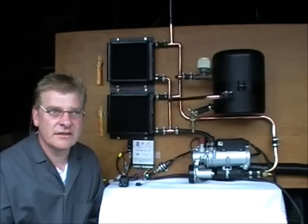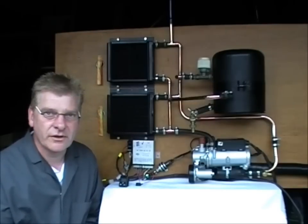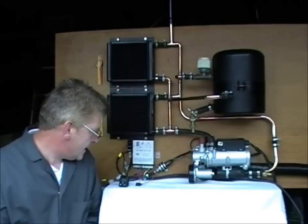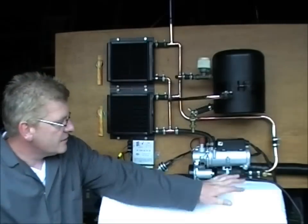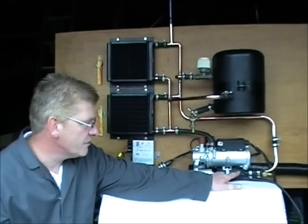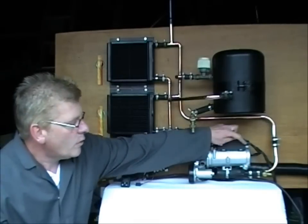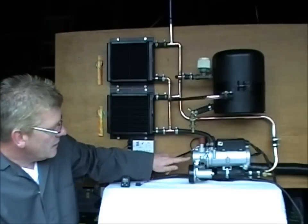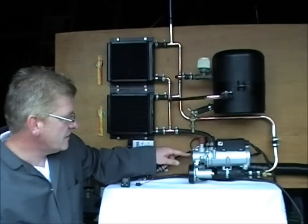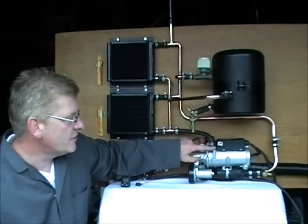Today we're going to have a look at the D5W Water Heater, 5 kilowatt, 12 volts, often found in Ford Transits, etc. First thing we want to explain is this is the water heater, this is the air blower, and this is the circulation pump. We have the glow plug there, and basically the wiring connectors here. On the end here, which you can't see at the moment, is a flame sensor. It's an optical device, and that's a little thermistor or thermostat to check the water temperature.